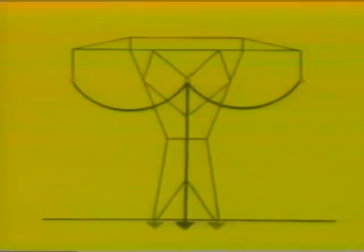Electricity is essentially amoral and totally indiscriminate. And by that I mean simply it'll go anywhere there's a path for it to go. It'll harm anyone who gets in its way. Put an imaginary lineman on that structure, standing near that center phase, with his feet on the structure and his hands in contact with the center phase. What does he represent at that point? Very obviously, he represents an alternate path to ground.